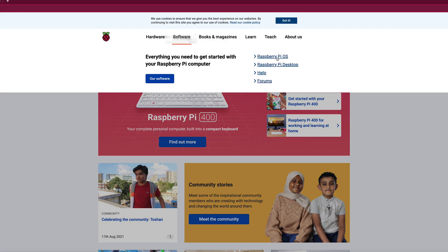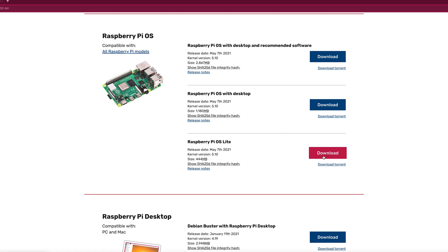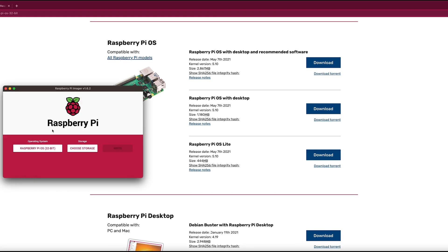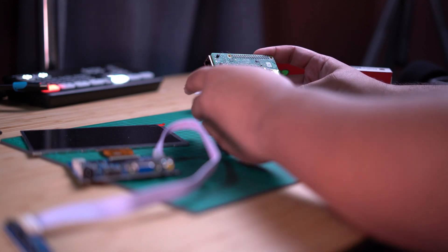To start with the software side, you will need to download the operating system for the Raspberry Pi. Head over to the software tab and click the Raspberry Pi operating system link. From there you will notice there are three selections of operating system — from top to bottom they differ in size due to different functionality and features included. For this project I am going to use Raspberry Pi OS with Desktop. Using the Raspberry Pi Imager, I will download the image to my micro SD card, making it bootable. It will take some time depending on your micro SD write and read speed. Once completed, take out the micro SD from the card reader and put it into the Raspberry Pi.